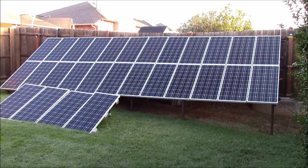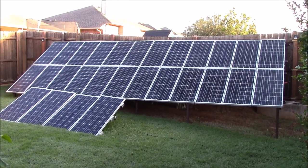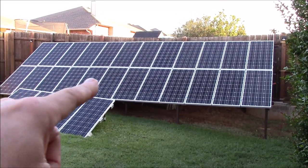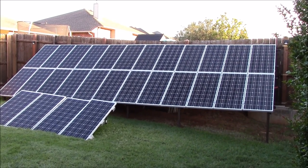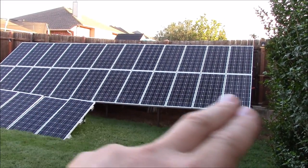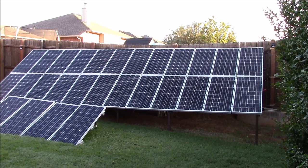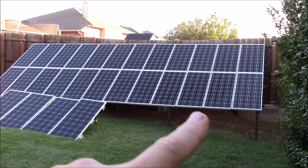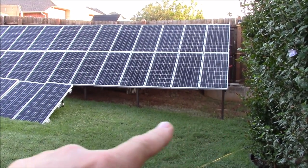Let's take a look at the solar panels out here in my backyard — small suburbia lot, not a lot of room to work with, but it works. This is the main array: 2400 watts, consisting of 24 panels wired in series — four series strings in parallel — running about 95 volts on a 100-foot run into the garage. Used all hardened bolts, super strut, and concrete precision grout to hold it up.